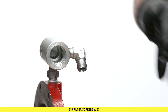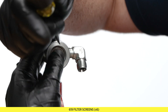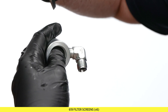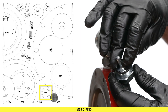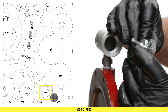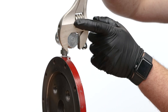Now we'll begin assembly using the Kimray repair kit. From where we left off in disassembly with the filter body in a vise, insert the six filter screens and use a pick or small flathead screwdriver to push them into place. Install the o-ring onto the filter cap, lightly apply oil to the o-ring, and install the filter cap onto the filter body with an adjustable wrench.